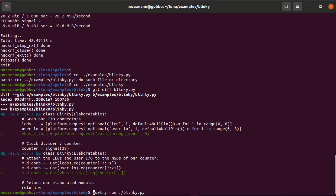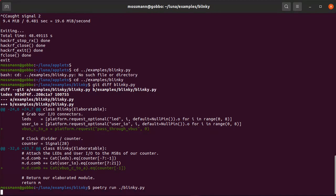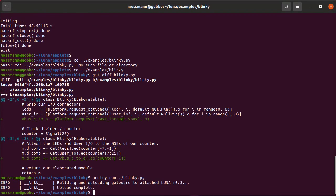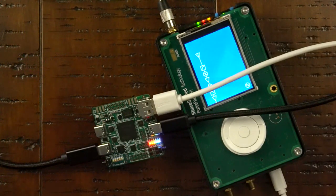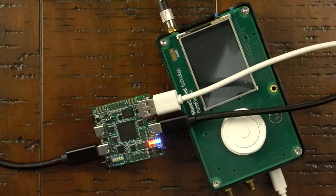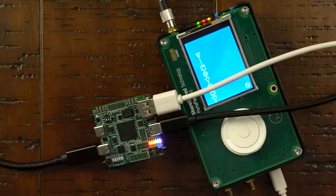When I run this modified Blinky program, it will synthesize a new FPGA configuration and install it on the FPGA. Then I should be able to see the HackRF power turn on and off. I execute the program and it's already configuring — in just a second or two it synthesized the bitstream. And now I can see the HackRF power actually turning on and off, which is great. I'm exercising the load switch that controls pass-through power from the target C port to the target A port.